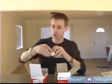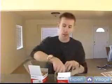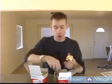Most of your regulations in this country are going to require a single cylinder, which has a key on the outside and a thumb turn on the inside. This is strictly for fire safety. You wouldn't want to get locked in your home and not be able to get out if there's a fire or another emergency.